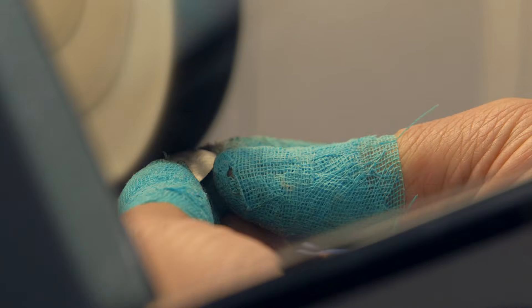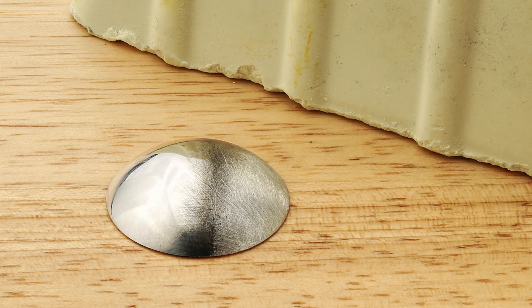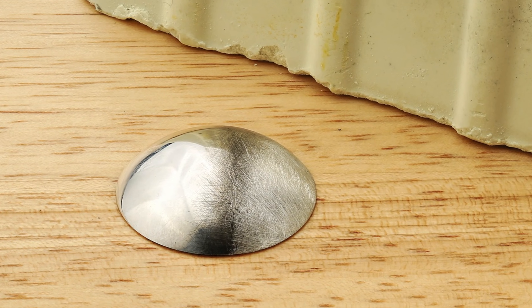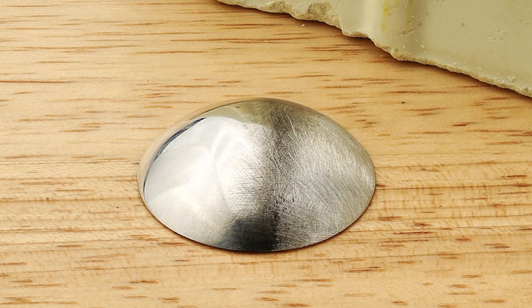The Yellow, like all the Luxi compounds, is silica-free and composed of aluminum abrasive in a water-soluble binder. Here's the result after polishing half the dome with the Luxi Yellow. You can see that the polished half is very smooth when compared to the 220 grit sandpaper, and there is a minimal amount of dark residue left that is easily cleaned.